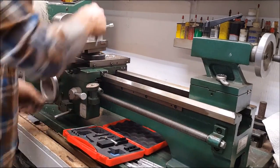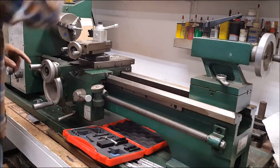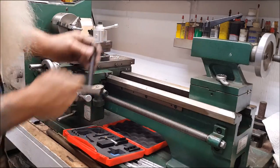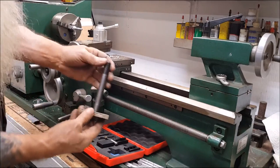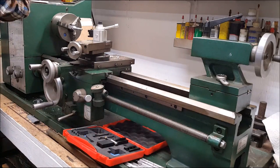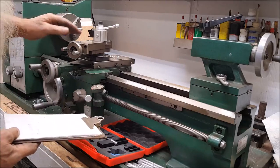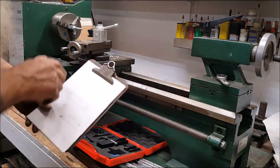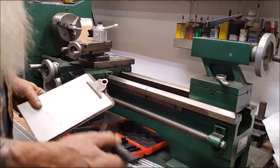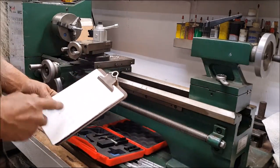The video at hand is this, I'll show it to you. The reason I was telling you about that other 4-post tool holder that's been up there on the sideboard all this time is that this thing is this size in that quick change tool post holder, and I really like that thing too. But just to mount this on here, I thought it was important enough that I should go ahead and make one of those T-nuts right there. I had done already the original one that was in there, this one. So I had mic'd it and drawn a blueprint and was looking for some metal to mill that out on the milling machine.